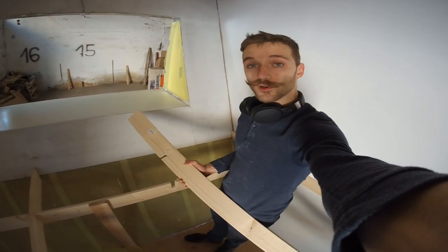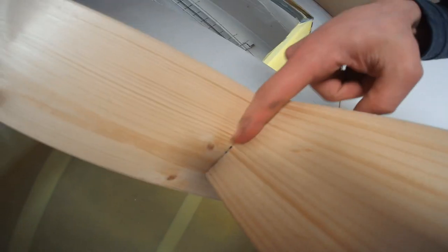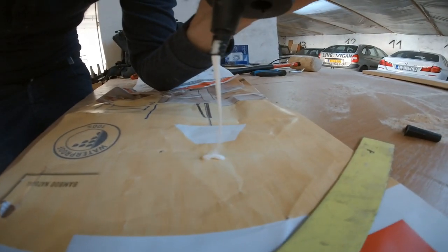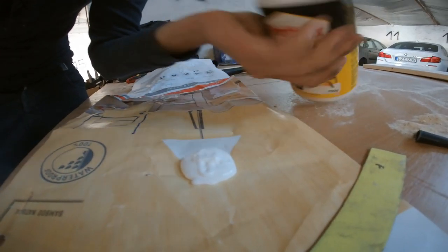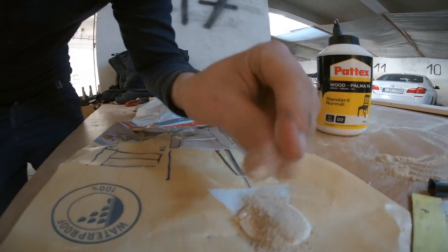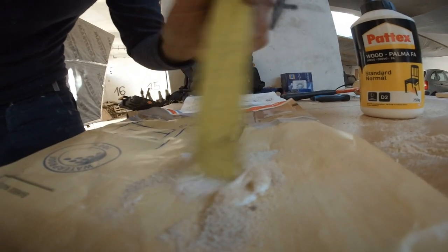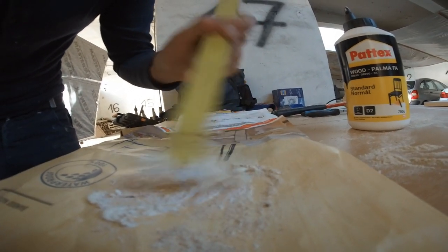It's time to glue up the joints for the bed frame. This one will fit in like this, and I'll add some wood glue and wood glue filler. You can make wood glue filler by getting some nice wood glue and covering it with wood sprinkles or wood dust — you mix that together and you get a wood filler paste. It's great when your joints are not that tight. After filling up the joints nicely, I can screw this part together.